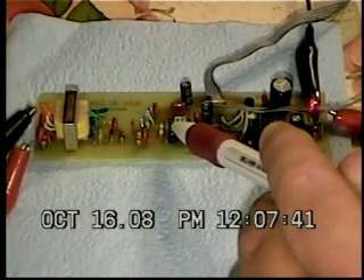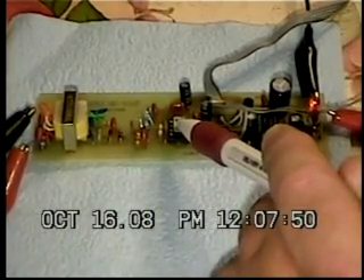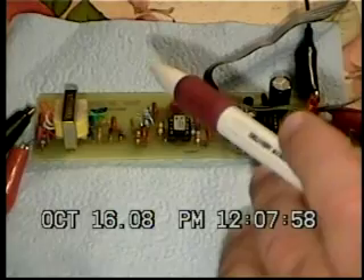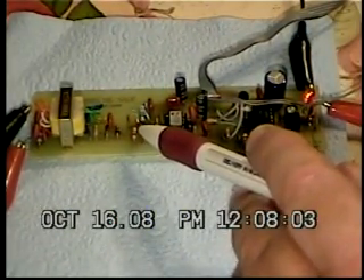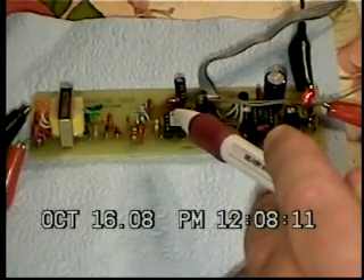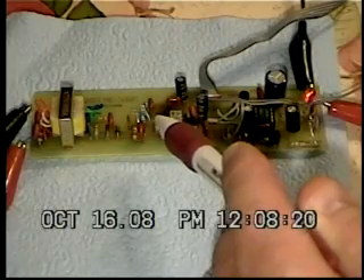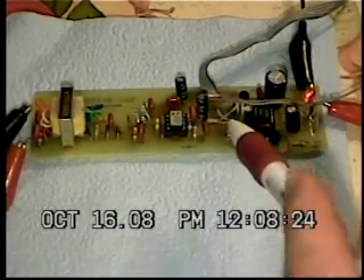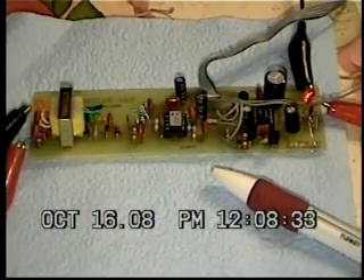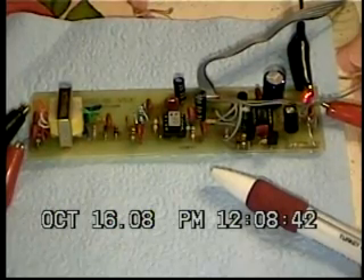The preamp is the RC4558 — it's a bipolar transistor low-noise audio op amp, nothing fancy, not FET. Because of the medium impedance being presented to it, this will actually work better than a lot of the FET op amps. We have a capacitor in the feedback loop set to give low-frequency roll-off below about 1500 hertz, and the second stage has another one. So essentially it's a two-stage preamp with active filtering to filter the lows out in both stages — that gets rid of amplifier noise in the part of the band you're trying to filter out.